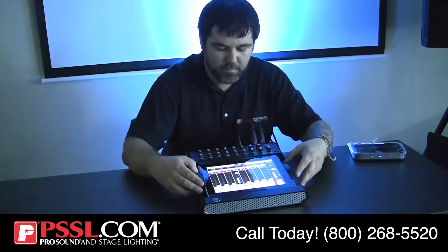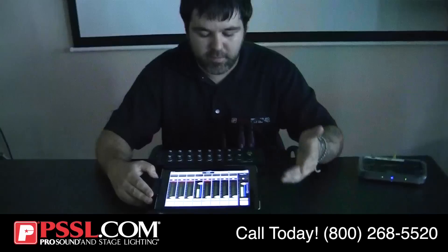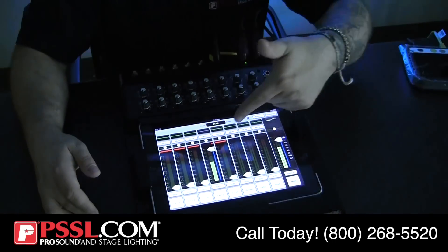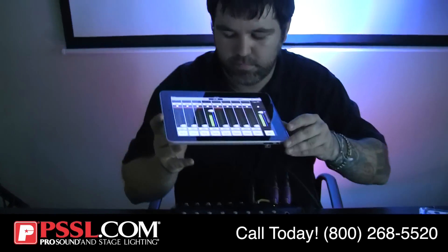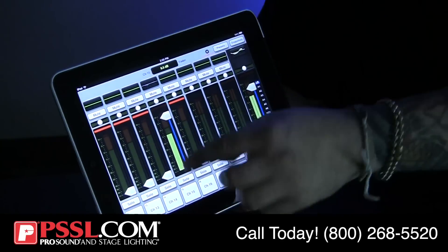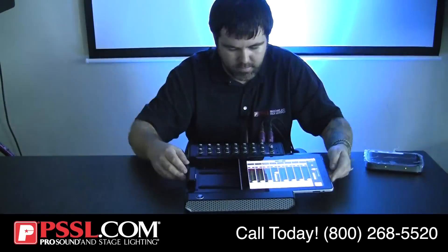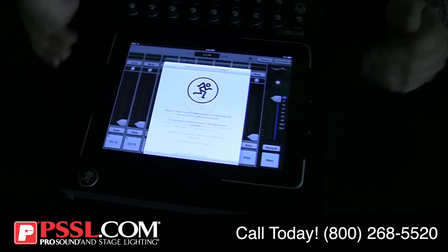One other thing I wanted to show you — earlier in the video I mentioned that your drummer would be able to control his own mix wirelessly from behind the kit. It doesn't have to be the drummer, but that's more commonly the guy asking for his own mix. Just to show you how this is done — up here in the toolbar it says it's connected. I'm going to go ahead and disconnect the iPad, and you'll see there's still signal going when it's not actually plugged in. As you can see, there's still signal going into the mix, and I still have control over the mix while I'm not plugged in. I'll go ahead and slide this back in now. Anytime you take the iPad in or out, you get the sync window letting you know it's synchronized to the mixer.